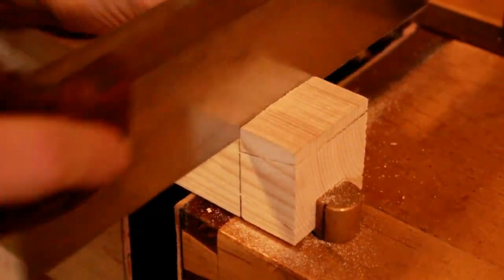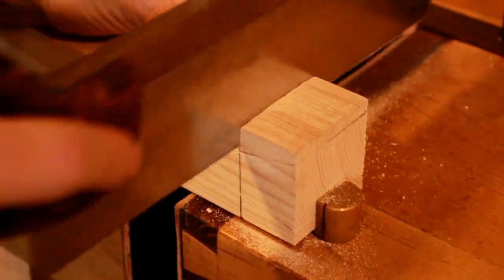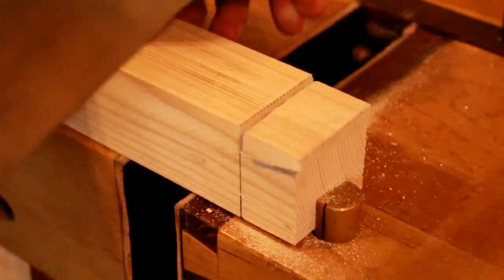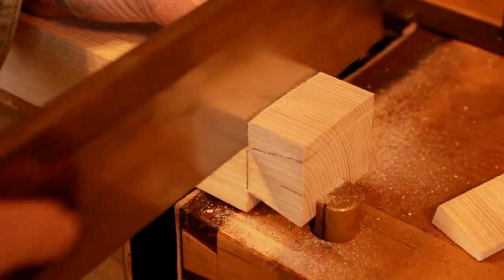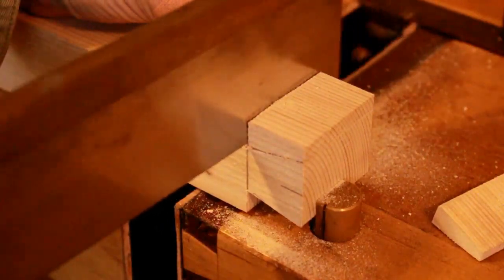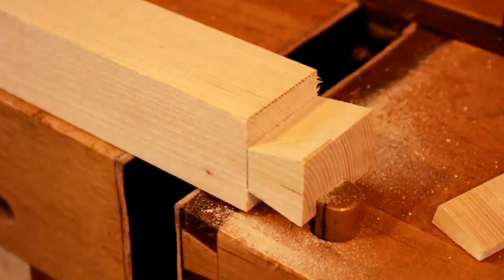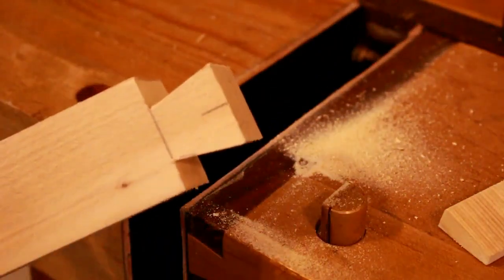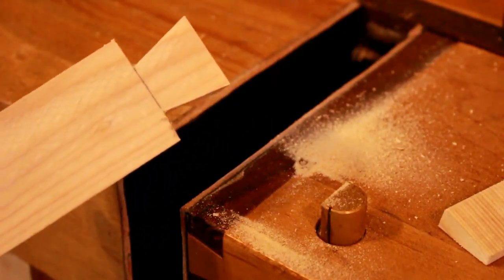You're also using your thumb — I use my thumb on the left side of the blade, and along with the knife wall it will keep the saw perpendicular and give you nice square shoulders that you don't have to plane or clean up after cutting. And that's how you cut a thick dovetail. You can of course clean it up with a chisel if needed, but pretty much you're good to go. I hope this helps those of you just starting out — thanks for watching.